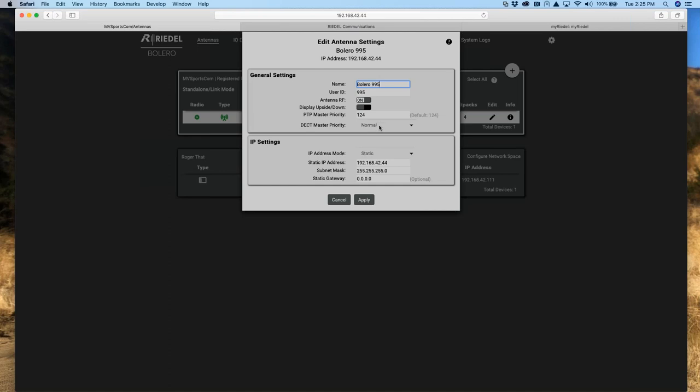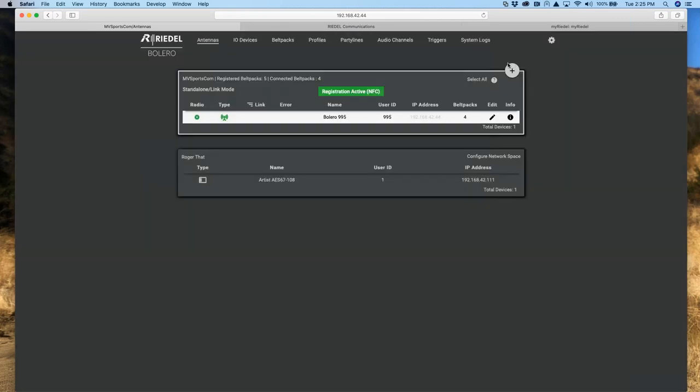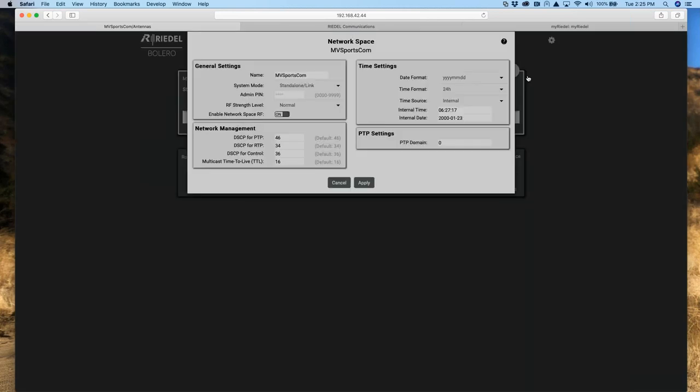Again, I think of when you're timing a CCU in the old days to a switcher input, you got your screwdriver out and you're swinging your signal left and right so that it falls in an allowable window of time at the switcher input. And if it's not in that window, then you don't get in. It's the same thing. It's almost a plus minus variance.